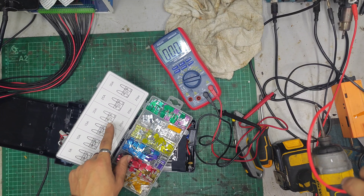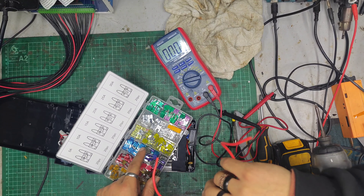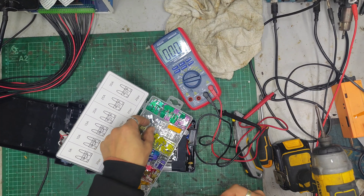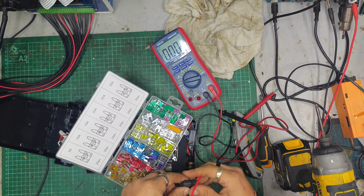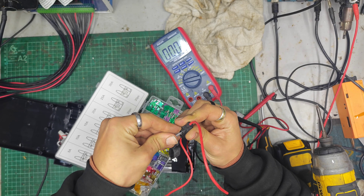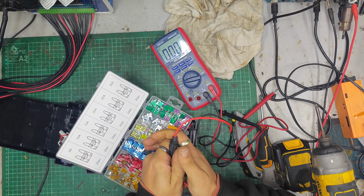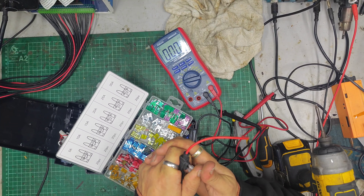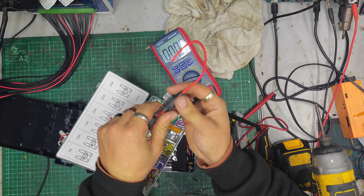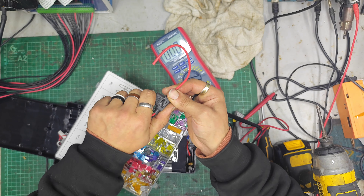What are we after? If it's a 250 watt 24 volt, that should be sort of 10-ish amps. Let's see how many amps the controller draws — the controller draws 12 amps peak. So let's put in a 25 amp fuse, which hopefully just won't melt then, as the old one did. The old one could well have just had a loose connection. But realistically, if a lithium battery is shorting, it's going to be pulling a lot more than 25 amps anyway — probably melt the nickel at 25 amps. There's our fuse inserted into our fuse holder. Pop the cap on it like that.